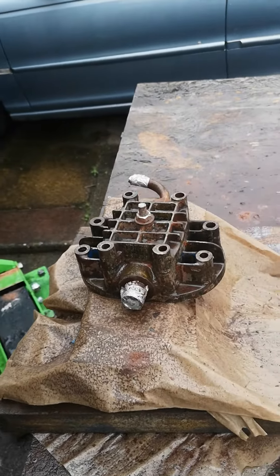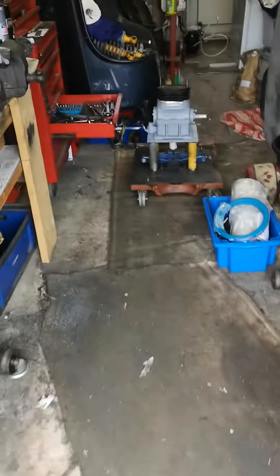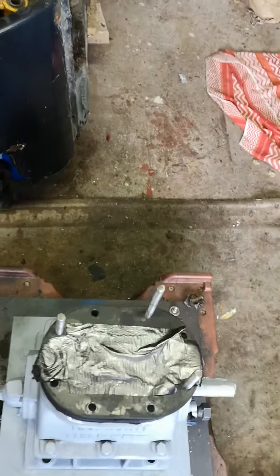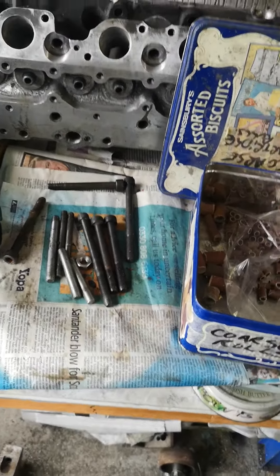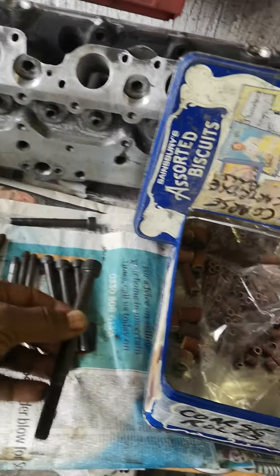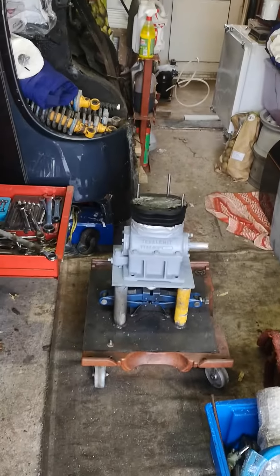It's still going to need some more work — probably about another 15 to 20 minutes with the grinder on that. As you can see, I drilled and tapped the top of the cylinder case for M10. I've got some studs in there — we'll have to cut some more studs to size. Managed to find a few bolts as well, some cap heads, but these are going to need cutting down to size because they're far too long. That's all for now — keep safe everyone.